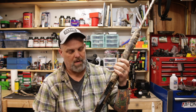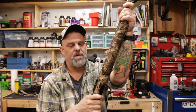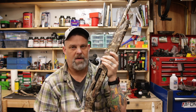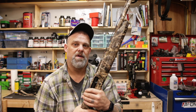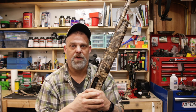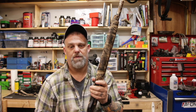I'll be taking this out shooting — I don't want to say it's fixed just yet, I'm 99% sure it is. I'll put probably several hundred rounds through this and make sure that fixes the problem. I have fixed some of these before with that exact fix and it's worked. One tip: that roll pin only drives out one way — out through the bottom, not out through the top. You need a pretty small roll pin driver to hook it because it's not a straight-through shot. Anyway, thanks for watching everybody — we'll see you again real soon finishing up our other project.